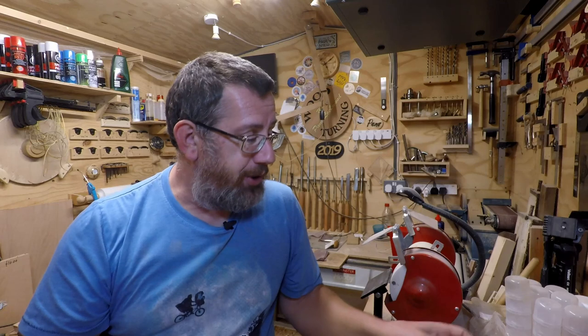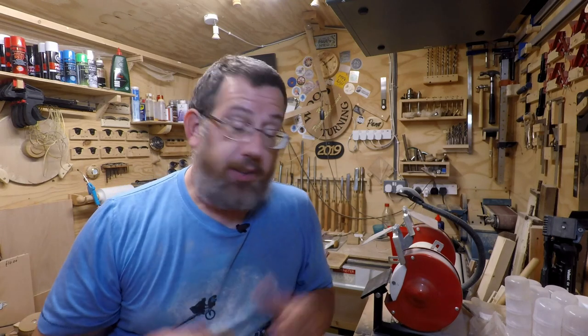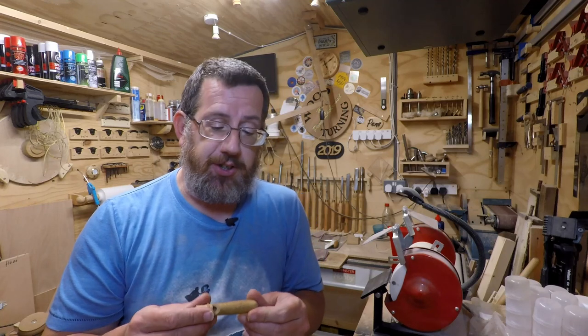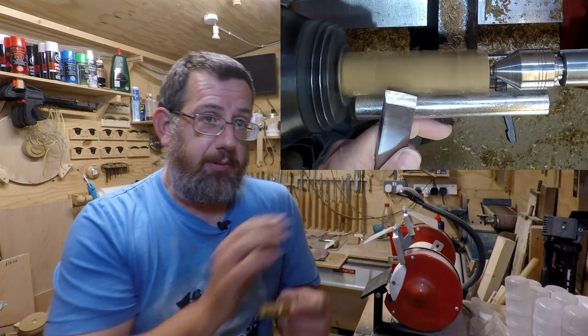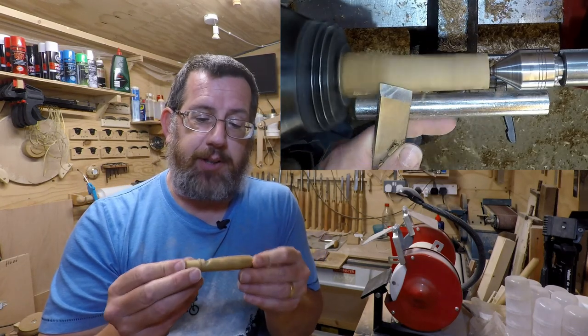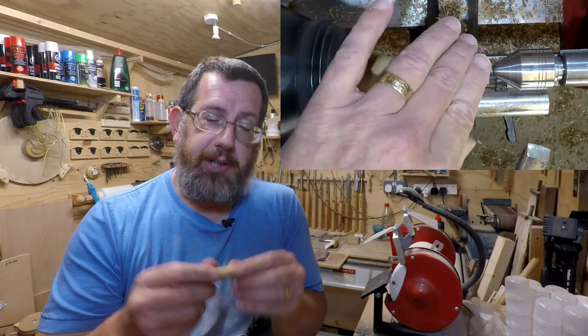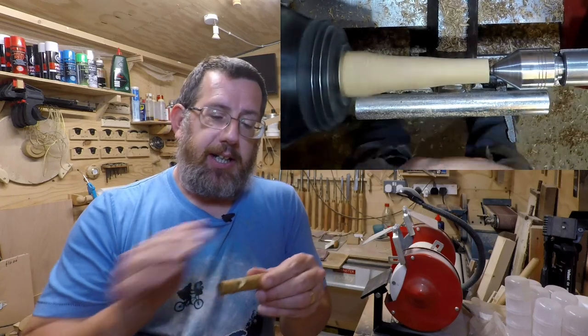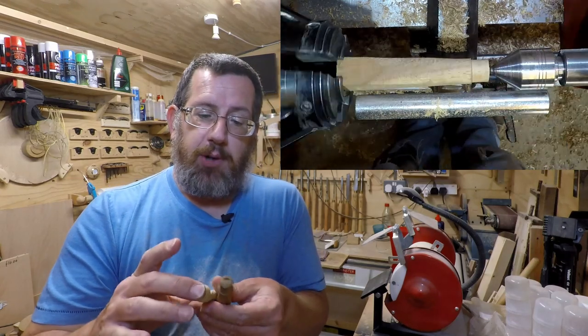On this one I think the hole is drilled down to about there. This is a good thing - you can just pick up any piece of scrap wood and stick it on the lathe and make a whistle out of it. You don't need anything special; you can even use a pen blank. I picked up this piece of Iroko here, and I started off with it between centers so I could put a tenon on it, put it into the chuck, turn it around and true it up. For both of these two whistles I have drilled a 10mm hole all the way down.